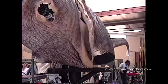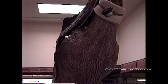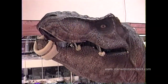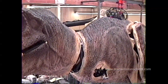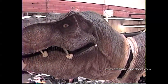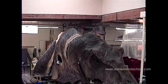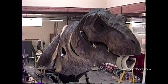With the hydraulics it wasn't much of an issue, but they finally tuned these dinosaurs to what the dry weight was. Then the T-Rex, which wasn't supposed to get wet, took on a lot of water. What everyone's doing here is taking the T-Rex through its paces — we'd have to see how far it would stretch. We'd move the head all the way up to its foremost position, and you can see that the skin needed to stretch three or four feet in some places. When it bends down, it had to not bunch up and crinkle in unrealistic ways. Finding the perfect amount of tension and stress on the skin that wouldn't tear itself apart but would still look organic was tricky on something of this scale. We ended up having to find different types of nettings for the T-Rex than we had in other movies, just because of the amount of stretch it needed and the durability of the fabric.